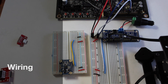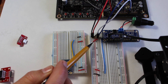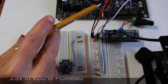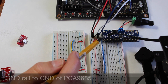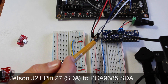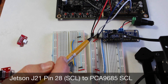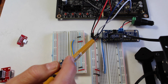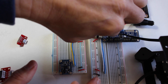Let's go over the wiring first. Out of pin 1 we have 3.3 volts coming to the power rail here. This power rail then goes to VCC on the PWM board. We have a ground on J21 pin 6 that comes to this ground rail and that also goes to the PWM board. We have SDA on pin 27 of J21 going into the PWM board, and pin 28 which is SCL also goes into the PWM board. This is on bus 1 of the I2C bus on the Jetson.